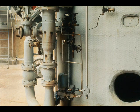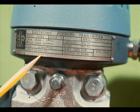We will next make a field range change and calibration of the E13 force balance transmitter. Secure a work permit to do the job, including a determination as to whether the system is intrinsically safe and the area classification. The 10 to 50 milliamp transmitter is suitable for Class 1, Groups C and D, Division 1, but only when the cover is in place.